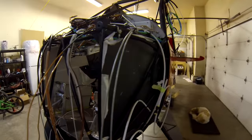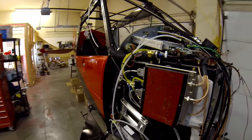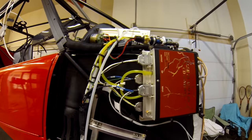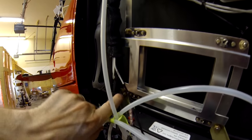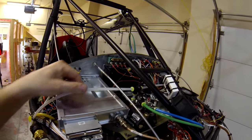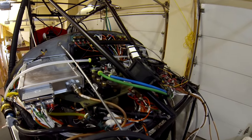I'll do a quick scan around and go into a bit of detail on anything that might help other people working on this area. This is the backup battery for the G3X, and then there's a backup battery for the dual electronic ignition light speeds. You've got to keep this clear of the cup holder. I've drilled a hole in here and put a tie-off with wax line — that keeps the cable clean. The main bundle has anti-chafe on it. I've used fittings from Stein for disconnecting, which makes changing routing much easier.